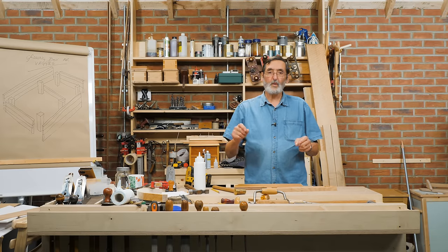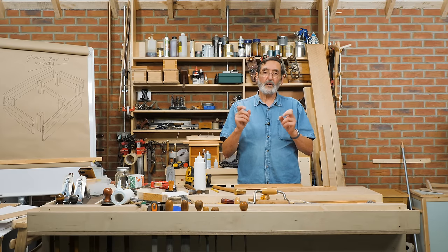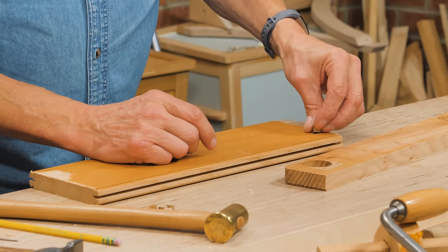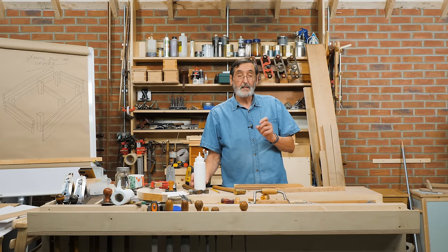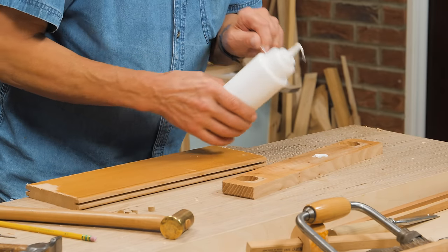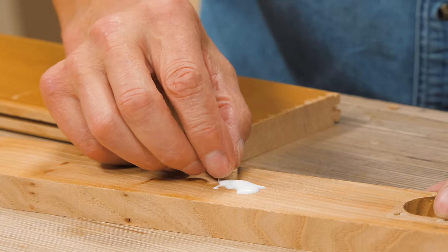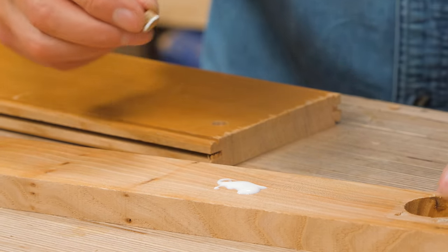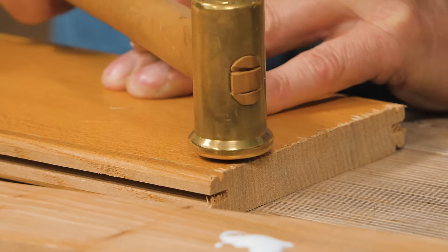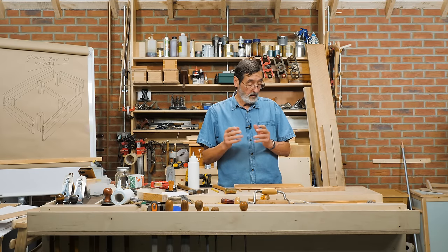Sometimes when working with wood we might want to drive a screw or a nail and the head looks very ugly. We can pre-drill a hole and then put a plug in there to cover the head of whatever you've sunk into it. Getting the right amount of glue onto the plug can be tricky, especially if you've got dozens of them to do. Put glue onto a scrap of wood, take the plug and run it through the glue — turn it around — and it'll pick up just the right amount. Place it into the hole you've bored, drive it home, leave it to dry, then plane or saw it flush. It makes a perfect concealed hiding of the screw.